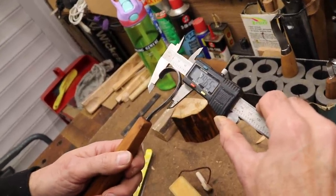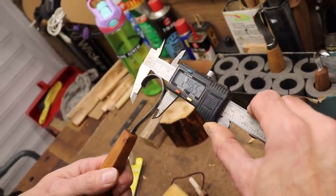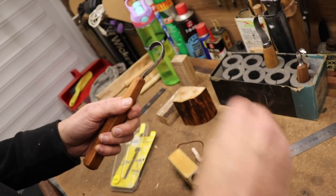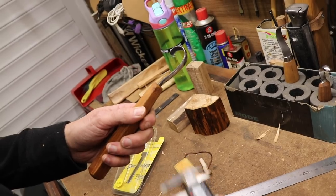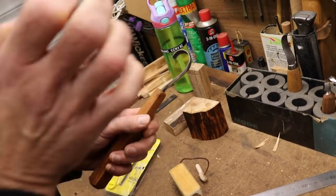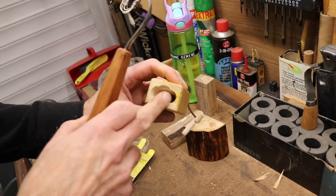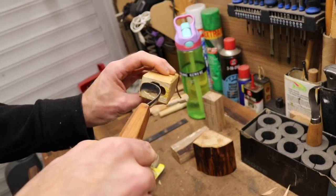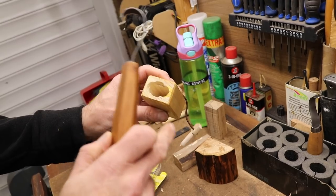So effectively, that's double the diameter of the drill bit that we're going to use, which is quite useful really, because we can just drill two holes side by side and still have plenty of material to remove. I'll probably leave a very slight gap so I don't have to wiggle it in, I want it to just slide in nice and neatly. And if we drill it a bit wider, we can leave the shape of the drill, because it'll hug this curve quite nicely, and we don't have to do extra work chiseling these corners out.